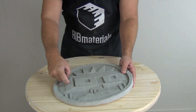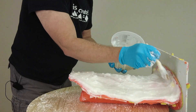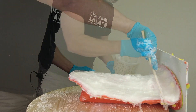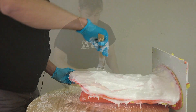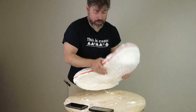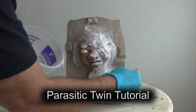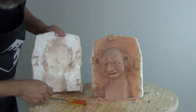This is a very simple casting, but you can see the benefit of being able to brush this into an open-face mold. We can also embed hardware in the back for hanging. Of course, we can use the same technique for mother molds — large support shells where we want a lightweight resin mother mold. Here I'm applying it over a silicone mold to make a lightweight mother mold that will easily snap back together. It can also be used for resin molds for silicone casting — that's how I made the mold for the little silicone parasitic twin series last month, using brushed-on thickened TC-808 and TC-804, and then casting TC-5110F silicone.